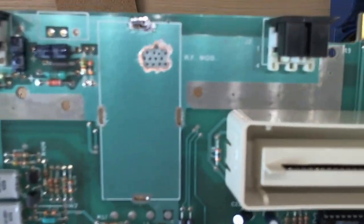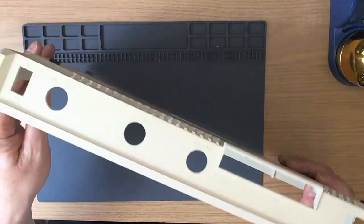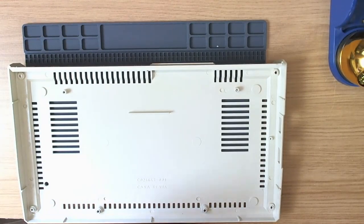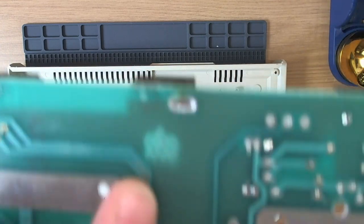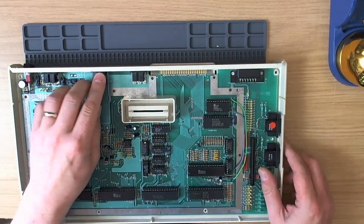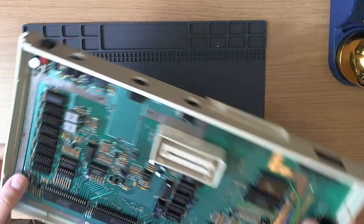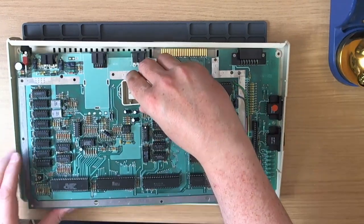Copper ground away — ready to fit the connector. That's the hole cut. It's turned out very nicely and it lines up well. I've just popped the connector on the board loosely — I've broadened that hole that had gone off-kilter a little bit, using the same Dremel tip that I cut the hole with. So that pops in there perfectly. I'll pop the board in just so you can see how it's going to look — there's our new connector. The board could actually do with a little bit of Retrobrite if we ever see the sunshine again in the UK.